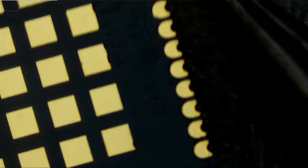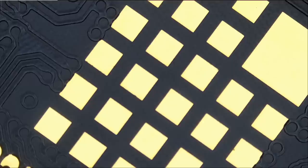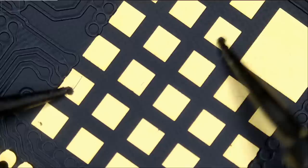The Wi-Fi chip is big, and we are not used to working with such big components under the microscope because look at this, we can barely see part of the chip. That's the Wi-Fi chip right here. And like I said, I believe those pads in the center are all connecting as one. So instead of having one big pad in the center, they divided the pads. Let's measure and see. Measure from here to here, to here, to here, to here, yes. So that's one big pad in the center.